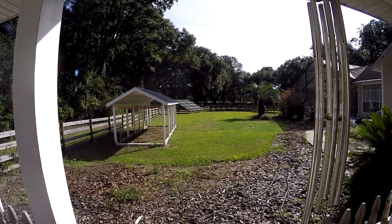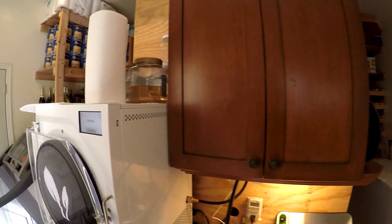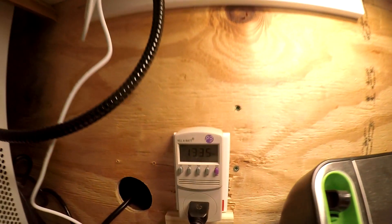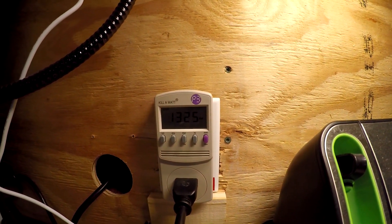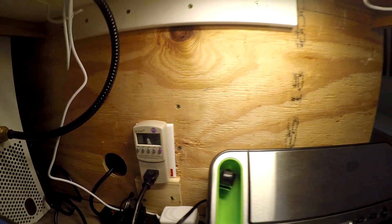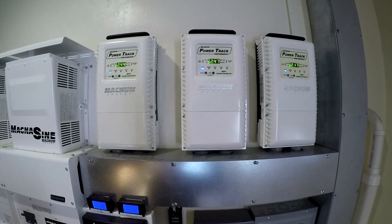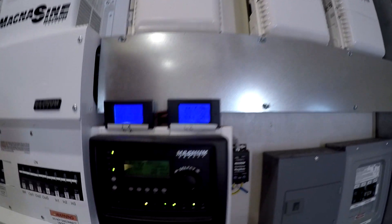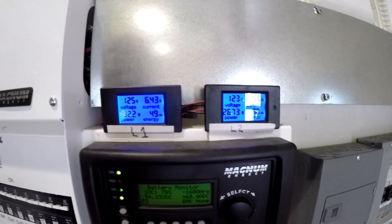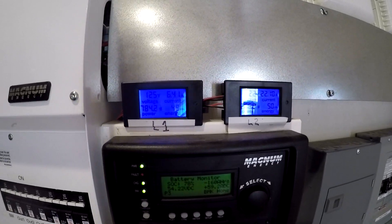Okay so it's about 10 o'clock and the sun is finally coming out. Still in the drying phase — it'll be here for a while. It's going between about 1,300 and 300 watts depending on whether the heater's on. It's probably a 1,000 watt heater. You can see from the panels now we're pulling in 6,000 to 7,000 watts. We're going up on the battery to 78%, putting 60 amps in and pulling about 3,500 watts in the house — plenty of power now.